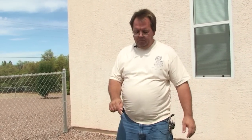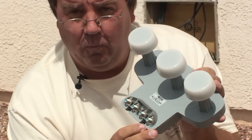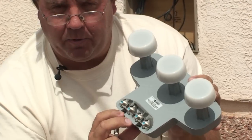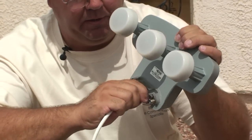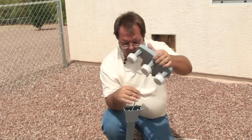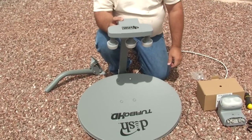Next step, we need to make a three-and-a-half foot jumper cable to put through the Y-bracket and through the polar plate, which will connect to our LNBF. This LNBF has one in-port, and it has three ports numbered one, two, and three. We're going to attach this wire to the number one port on the LNBF, and we've tightened it down snug — just finger tight, that's all we need. Now the LNBF rests on the Y-bracket like that.